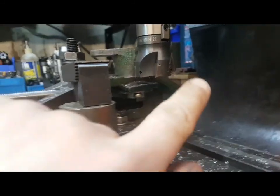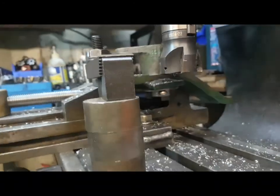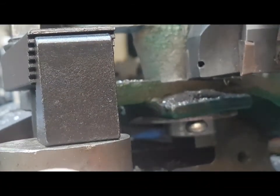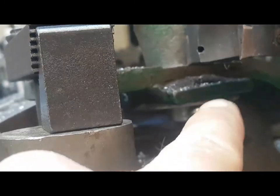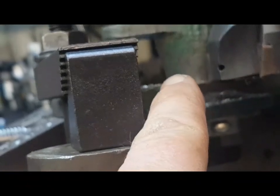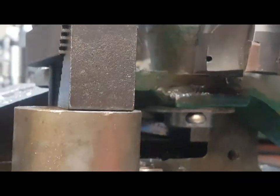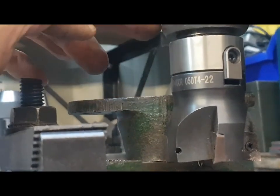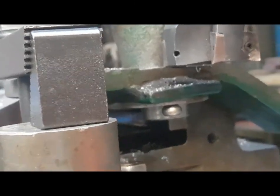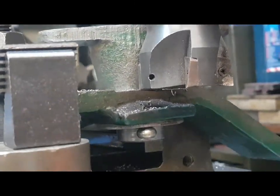It looks a bit skew-whiff because when Marshall's built this, zoom in, this piece isn't even welded on straight, so that's why it's been a bit awkward to clamp it up. But turning the stub against the back plate of the lathe when it was turned, and then setting the machine face against the quill with nothing in it, it should all be good enough for what it is. It's only a pedal, you know, it's not like a crankshaft or anything specific.